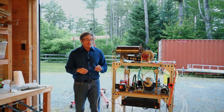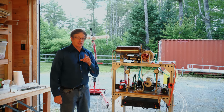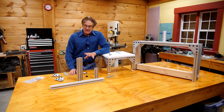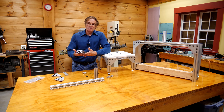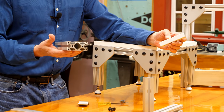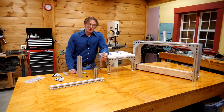What I'd like to do now is review a little bit about this 8020 material — it's really great and I highly recommend using it. The central component of the 8020 products are these extruded aluminum beams. They come in a variety of different sizes, from as small as 15mm cross section all the way up to 150x150mm — 6 inch by 6 inch — big enough that you could literally build a house from this stuff.